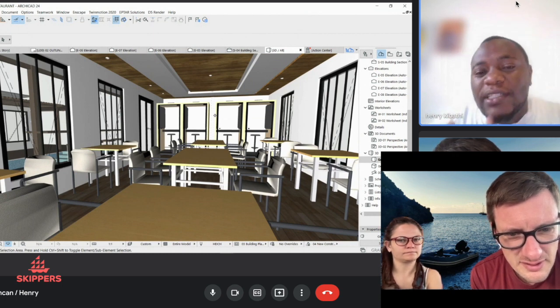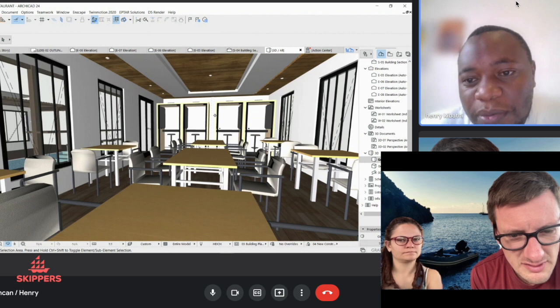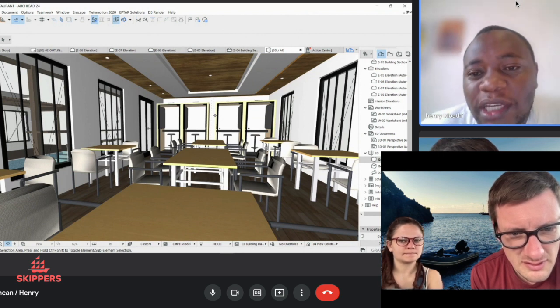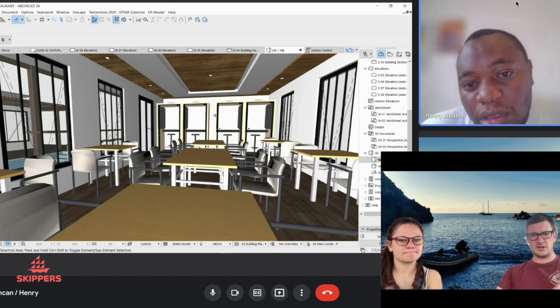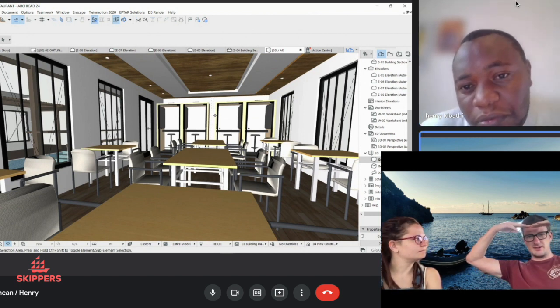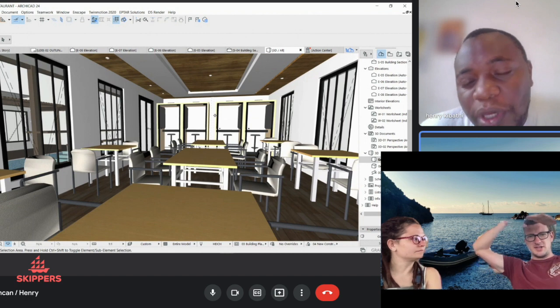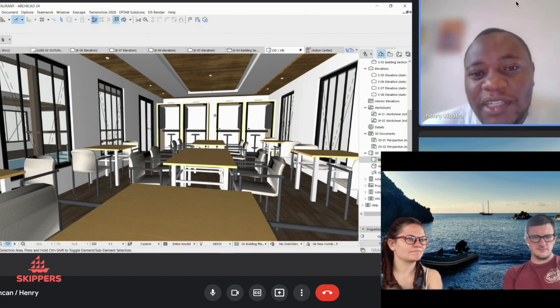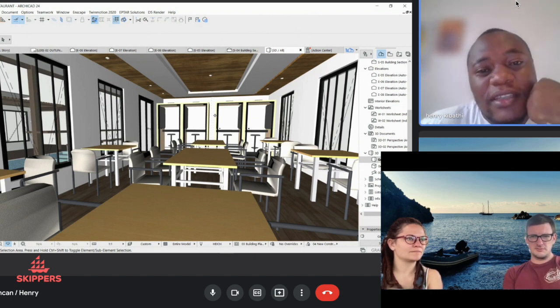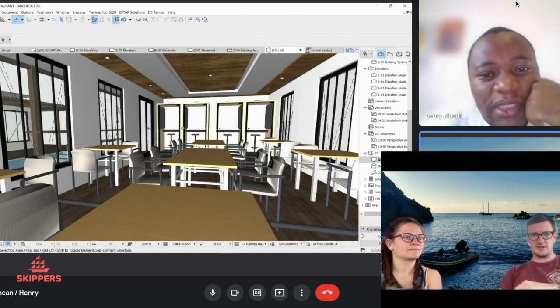We can decide that we won't work with gypsum, but if we work with timber, timber can be removed. We can do the ceiling in such a way that you just remove the ceiling, and then the containers can be moved. We could have the ceiling just meet in the middle. If you're doing timber on the ceiling, like 6 or 12 mil timber, you can just do it down the middle and have it meet in the middle of the two containers, so that each half has this. Then when you pull them apart, it's just how it is. If they come together, it's complete. Yeah. Okay.